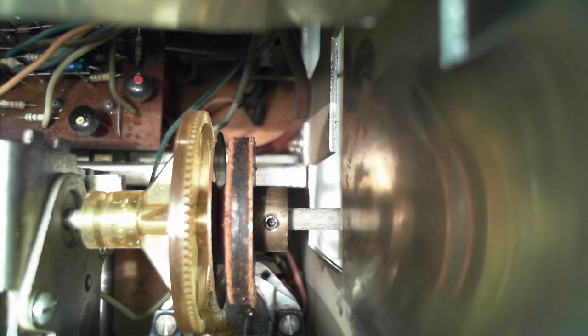Well, maybe that's the solution though. What if I forget what's gone wrong? What if I loosen that set screw and drive the clutch mechanism hard to the left to pin harder against the yellow gear? It just doesn't seem to make sense to me at all. Look at the rubber clutch they put in this thing. They didn't put it in there for me to look at and talk all around. It's in there to separate and to connect again. It's got to be there to enable the yellow gear operation, to separate the knob when the buttons are being pushed. Otherwise you have a knob spinning on the front of the radio.